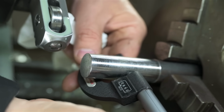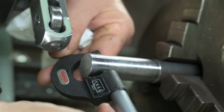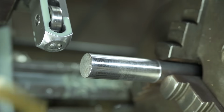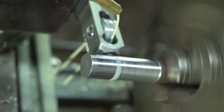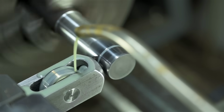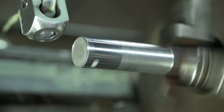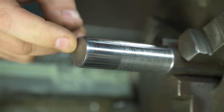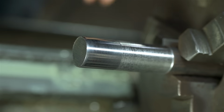I mean, technically the 2 is rolling a little bit higher there. Probably only a few tenths difference. I'm going to crank down the pressure just a little bit more and see if we can get some of this hazing out. Well, that certainly made a difference. And if you can see that lip or that edge, like it rolled that corner off quite a bit. So the forces are significant.